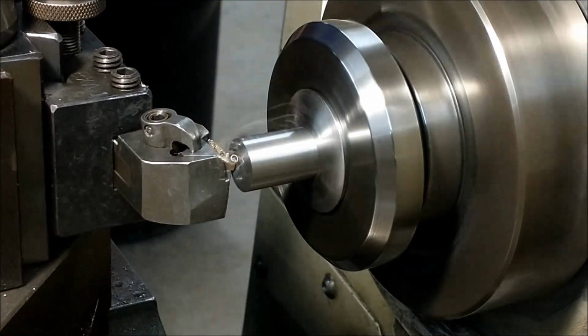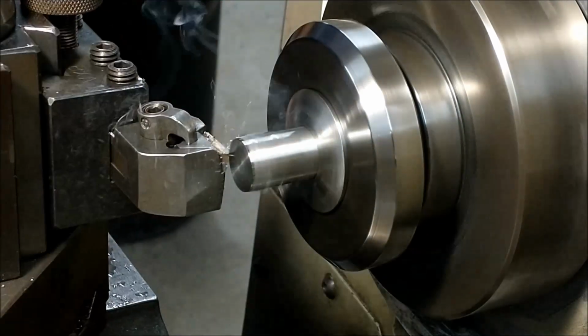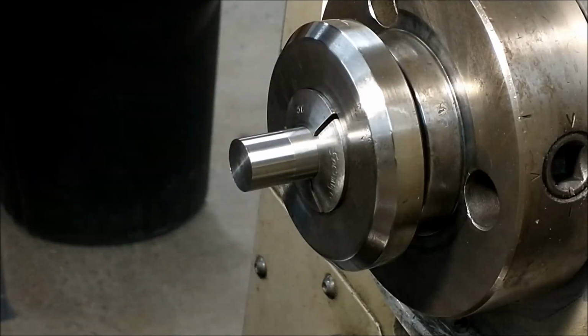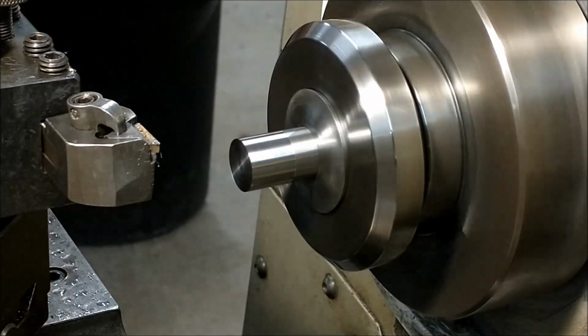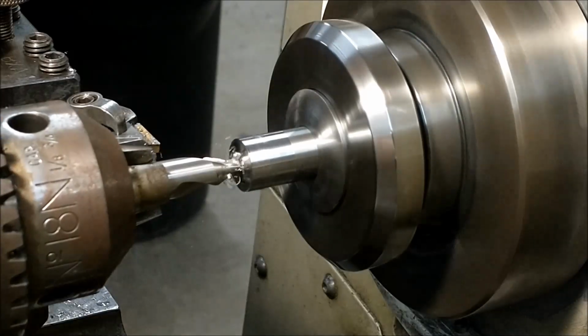The pocket that we just bored in the body is going to accept 2 bearings, so make a bushing that goes in between whatever the bearings are that keep the bearings separated in that pocket. A nice loose fit is all you need, just something to get in between the bearings, locating on the outer race, and that is all you want it to locate on.